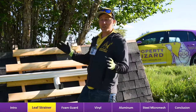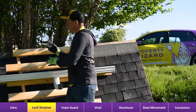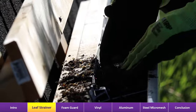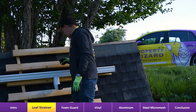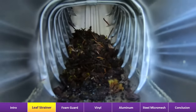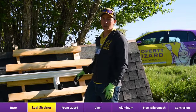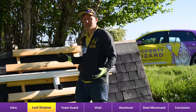Starting out, this is our all-open gutter with no gutter guards at all — just a leaf strainer installed. These are quite nice because there's a hole at the top so all your debris and gutter butter can still collect around it and a little water can flow through. The biggest advantage is that it's still easy to clean. The big debris bunches up around the leaf strainer so at some point you will have to clean it out. It's not completely foolproof, and some debris can fall through into the downspout. Advantages: easy to clean, accessible, you can see what's going on. Disadvantages: it still lets a little debris into the downspouts and perimeter drains, and it has to be cleaned.